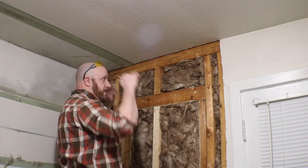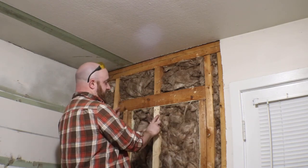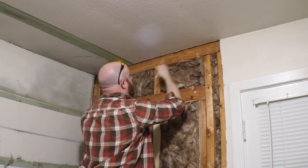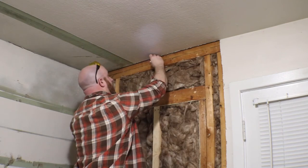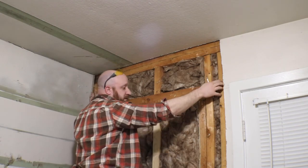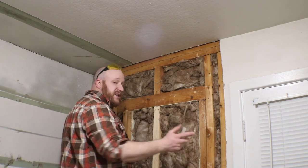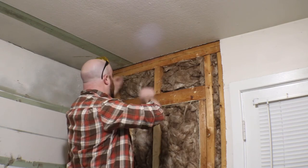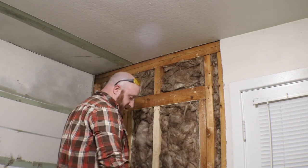Something I want to show you right before I get this drywall going. When you're going to put drywall up on a studded wall — these are studs — what you want to do is on the top side, put a little mark, a little V with the point pretty much in the center. You'll have one in the corner and one right on the edge. Do the same thing on the floor. Once I get that piece of drywall rough-fitted in there, I'll put a chalk line from here down to the bottom and snap it on every stud. I know professional drywallers have different methods, but for DIY, this is what I'm doing in my house.